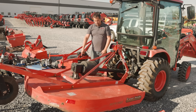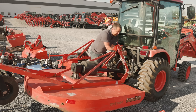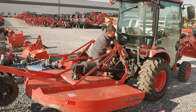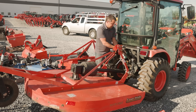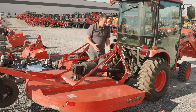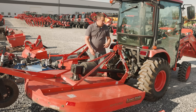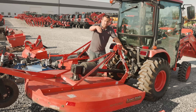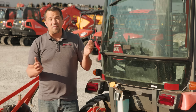I also have an adjustment to make up here on my top link. You'll see when you look at my mower how it's really tilted right now — by sitting here and turning the upper link I can extend my top link and lower the back wheel on my cutter. When setting up things like mowers, usually you want them slanted forward just a little bit while cutting because they tend to cut best that way. For something like a box blade or a rear grading blade you want it exactly flat. I also have an adjustment over here on my side link — if I was using a rear blade and wanted to crown a road I might shorten or lengthen this to change the adjustment from left to right.